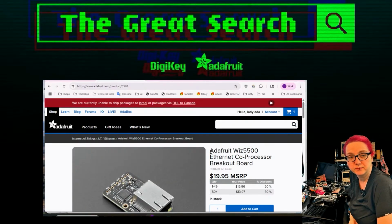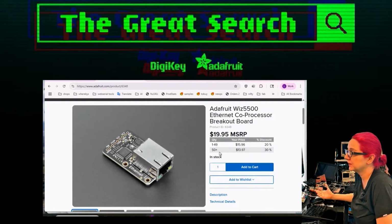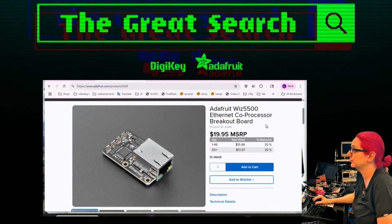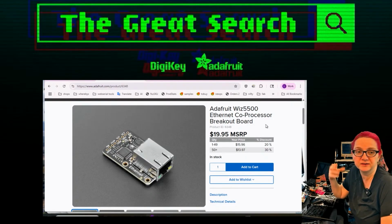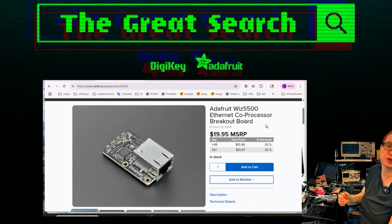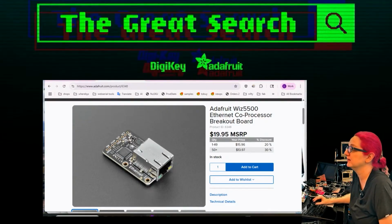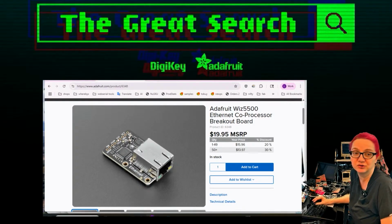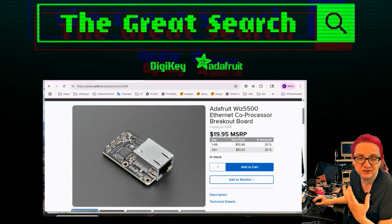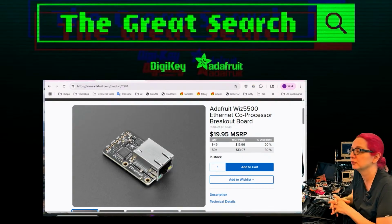On DigiKey.com. Okay, so this week, a couple weeks ago, we released the W5500 Breakout because people wanted to add Ethernet easily, and I got a lot of requests to add a way to do PoE with this, or a version that has PoE support. The PoE pins are the 4 pins that are not connected to the WIZnet. So there's no electrical reason and no firmware reason not to do it. It's just I have to create the PoE module.